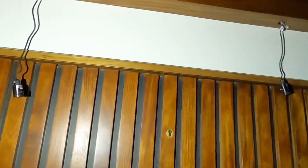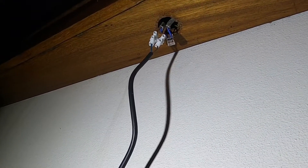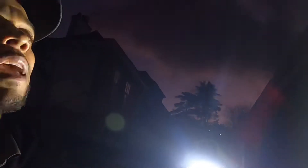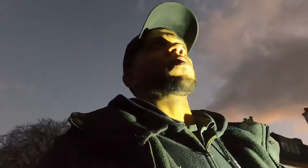So what we had here — as you can see — we've now separated the incoming positive into the brown of the light and the outgoing negative into the other brown, which then goes on to the next light. Whoever installed them was halfway there. The ones that were crossed over where blues were in with browns — the browns were in the correct location except for one — and the blues just needed to be separated and continued through. I think when given instruction they heard 'cross them over' and that's what they did.